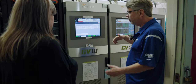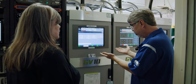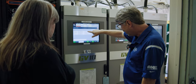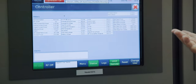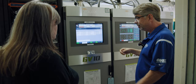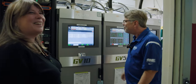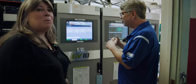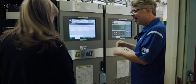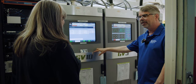This one, we don't have to do that with. We don't bother multiplying plate current times plate voltage. This is a solid state amplifier anyway, but you can see it is measuring the DC to RF efficiency right here at just under 72%, which is really incredibly good. This message not sponsored by Nautel, but this is the best transmitter that is out there.